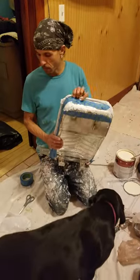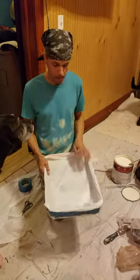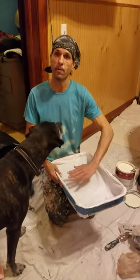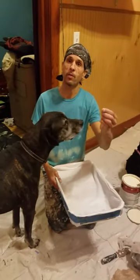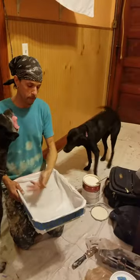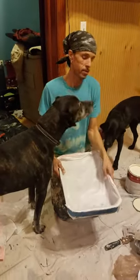If you leave paint in the tray unattended for too long, what happens is a thin layer of paint will dry on the surface. Yeah, and then you get the nips — you get like a plastic bag made of paint. And then that ends up breaking off into little chunks into your paint and onto your walls. Yeah, yeah. And then it's just a nightmare.